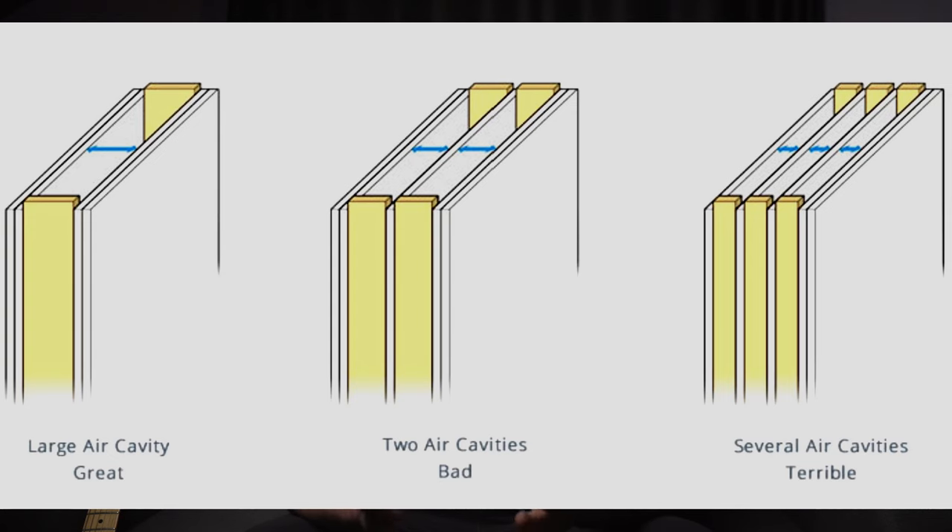While their proposal was to build another layer of insulation on top of the existing ones, after a little bit of research I found out that this would not be optimal because we would create a triple leaf system. For anybody who doesn't know what this is — I didn't either — it basically means that you create two gaps between walls during your soundproofing construction. In most cases it's much better to just have one bigger gap than two little ones.